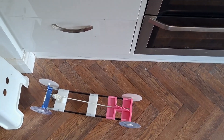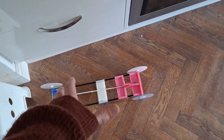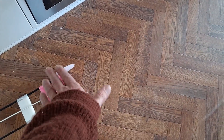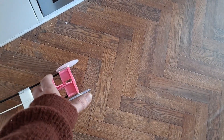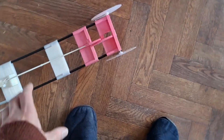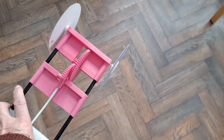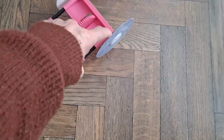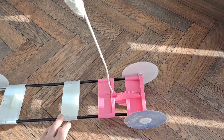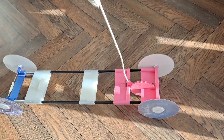There's a good chance that if we point it in the right direction it might do the full distance — I might have to adjust the wheels a little bit. While I'm aligning things I tap one side and then the other to get the alignment, to get the steering. At the moment that's going left a bit, so I need to tap just there to straighten it up. Right, that's the tipping point so stop it there and let it go.